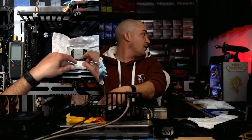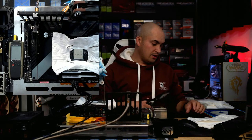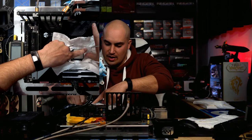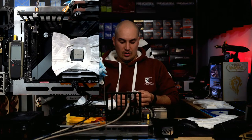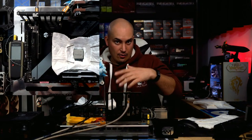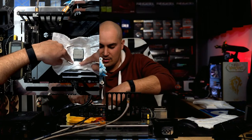So, okay, now I usually prepare an insulation like this to avoid water around the socket, and then with small pieces to fill the holes. Because water is really bad, and since we probably have to do a lot of reboots, it means we can go down to minus 192, then have to go back to a less cold temperature and then go down again. All this process makes a lot of condensation, and a lot of condensation, well, it's game over, since I have to dry the board, and it's not good.